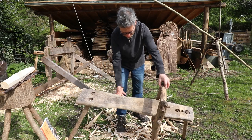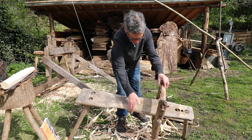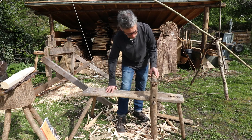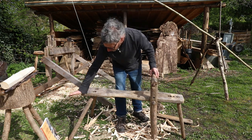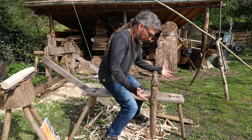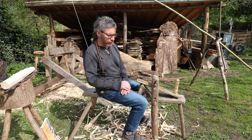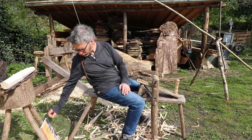The body is just a piece of ash. I've seen much thicker ones and thinner ones. I've carved out here so you've got more room for the inside of the legs. Do customize it so it's comfortable for you — carve out a seat on the back, put a cushion on top, because sometimes you could be sitting on this all day. At the back we've got two legs that lean backwards and out for stability, and the front leg just leans forward to keep it solid. The legs knock out so it's easy to disassemble and put in the back of a car.